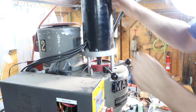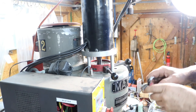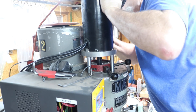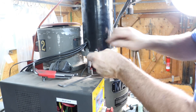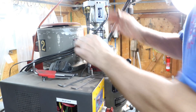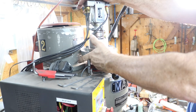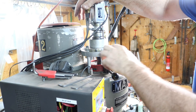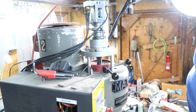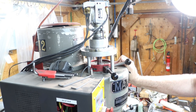We'll start by removing things here — I'm going to have to take this all the way off. It's worked flawlessly, really, since I've had it. It works fantastic. This goes down and engages into the drawbar. It takes a different drawbar than the normal one, but this will go up and down, suck on down when you apply the air. See how it comes down? There's a piston inside here that draws it down.